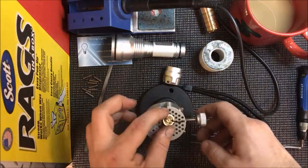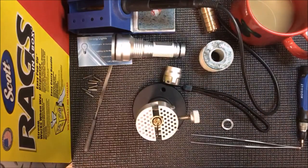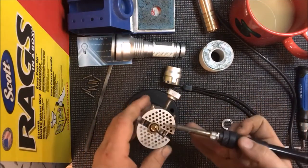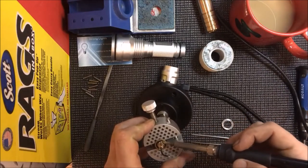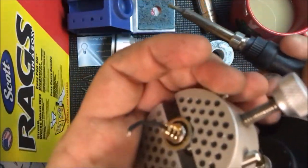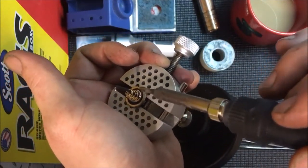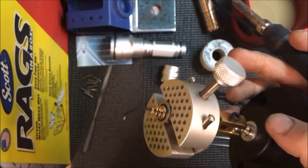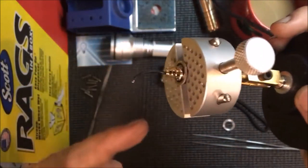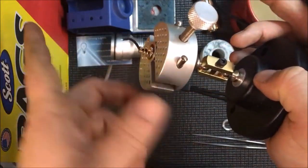This is not optional. When you're pulling a lot of power through — six amps times 4.2 volts is about 25 watts — you really have to be conscious of how much power is going through this little spring. It will melt, I promise you. It might not do it right away but you have to do this, especially if you're using good cells that really crank out the watts. You can see that wire is secure — function over form in this case. Just barely touch the soldering iron — get the tip wet and just touch it. What you don't want is solder feeding up that wire making it stiff, because when you put a battery in and compress that spring that stiff wire will dig into your battery.